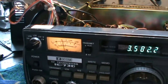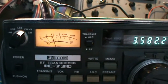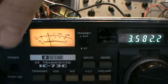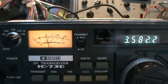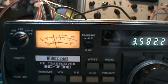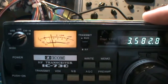I'll show you what the effect is. I've now readjusted those transformers and set them to an optimal signal through the narrow filter, without losing too much at the wide filter setting. You see the difference now is just about one S-point. Of course, the insertion loss of the crystal filter — we can't really level that completely out because we'd need extra gain and building an extra IF stage is a bit too much. But if it's only about one S-point, then it's okay I think.